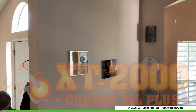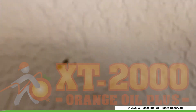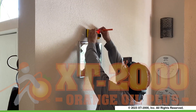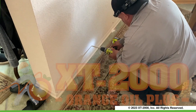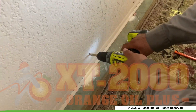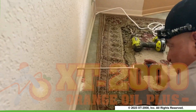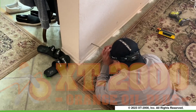This is the process and how it will save you from having to do fumigations. First, you've got to show up to the customer's house and identify that kickout hole and find where the infestation is. That's where the termites are coming from. Once you've found it, take a stud finder and mark all of the studs in the wall. Then you drill a small half inch hole in the drywall at the base of the wall at an angle so you can slip the boroscope into the wall to peer and look at all of the studs behind that drywall so you can figure out which ones are infested and which ones aren't.